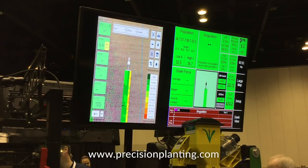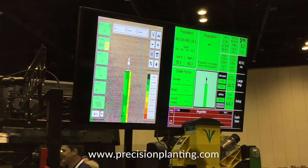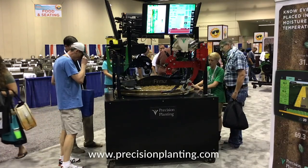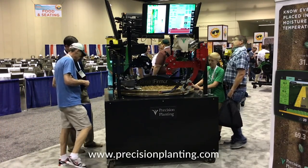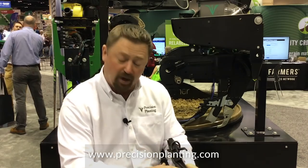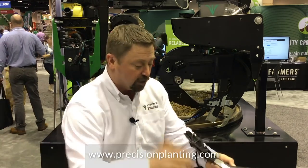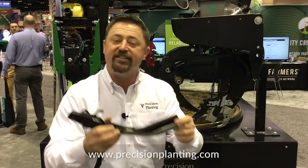Organic matter is another thing we can sense with Smart Firmer — the ability of a soil to hold water. I look at this as drought potential. If a soil has low organic matter, it's going to have low water-holding capabilities. And so if we have that, in order to feed the crop we need to keep it raining; if the rain shuts off, we're going to have some drought soils. But we're measuring this spatially now and we know where areas of high organic matter are and low organic matter. It's the sensing technology at Precision Planting.